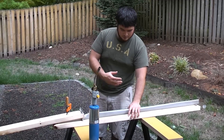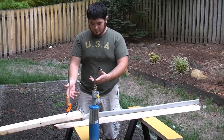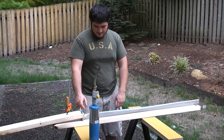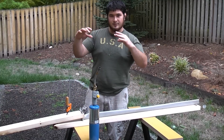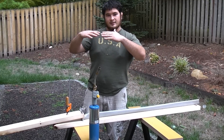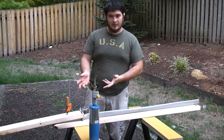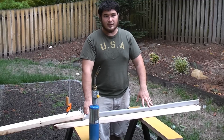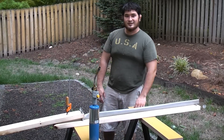You just want to clamp it until the end closes up and your spacers have touched down on the warp. Now that this is set, I'm just going to let it cool. Once it's cool, we're going to come back and build in some transition here so that when you have the end lever in place, it'll have more support behind it so it won't break or bend — which is really important for the schedule 80 pipe. I'm going to let it cool and then we'll go on to the next step.